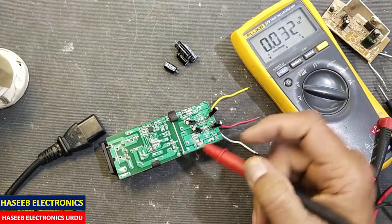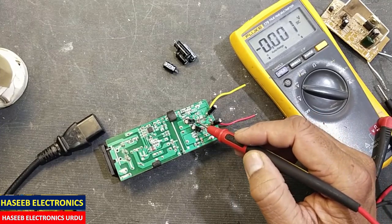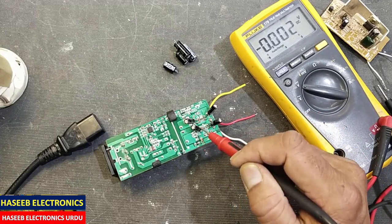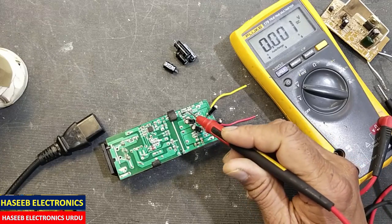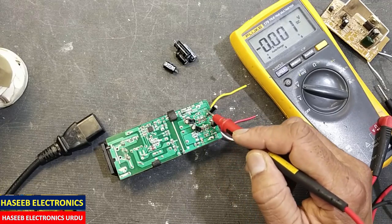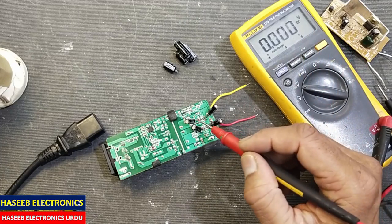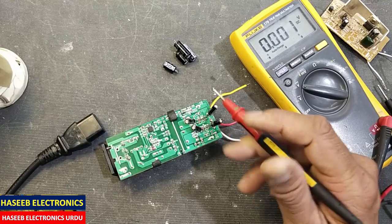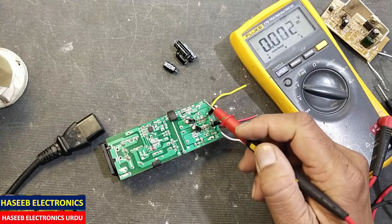There are many causes for voltage drop — if the capacitors are not holding charge properly, they will not allow voltage to build up on the output DC rail. The supply will not fluctuate too much in this case. If we have a short circuit it will fluctuate, but if we have open capacitors, the voltage will simply drop.